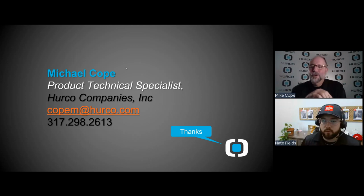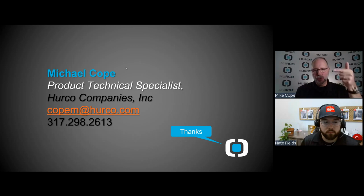Yes and no. So yes, you would, depending on how tall the setup is on those vises. But again, I told you we need to know what that distance is off the table when the head's at 90 degrees. And on Hurco, for example, depending on the size of machine, that is high enough that it doesn't really hinder you from doing larger work on the rotary, but it is tall enough to allow you to clear standard or traditional height 6 or 8 inch vises with some parts in them over there. So yes, it very well could. So you're going to have to be careful of that. But they've kind of worked that buffer, if you will, into the bottom of the Z-axis travel, so you aren't running into that.